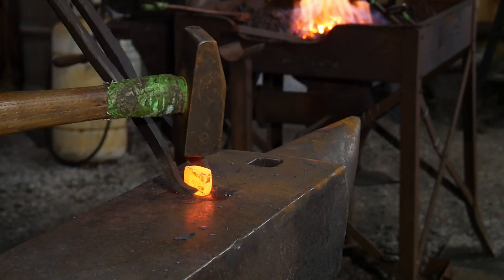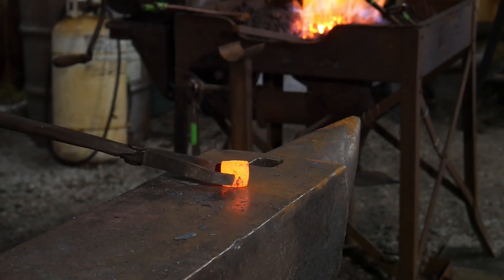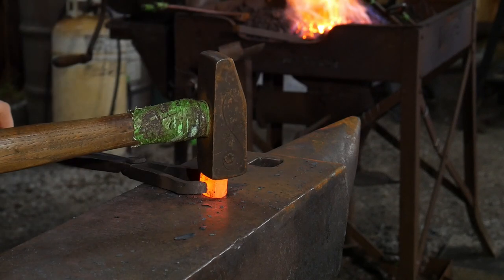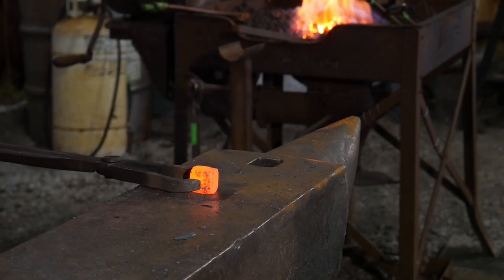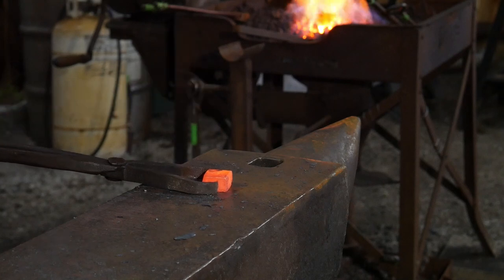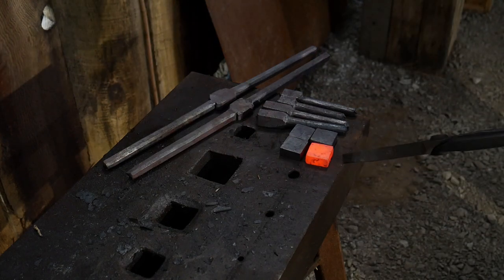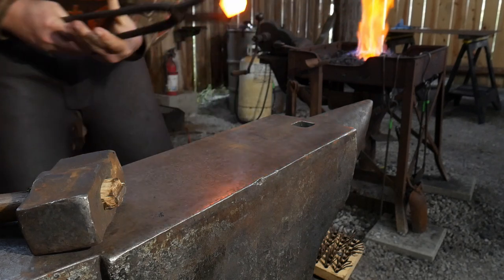There is a little trick here: you do have to have enough mass that you can actually catch some threads, so be real careful when doing this. If you don't have enough mass when you cut off the piece and it's not thick enough in the final dimensions, you won't be able to catch any threads and your door knocker will fall off. You can see all the little parts laid out - I've got multiple door bolts and multiple nuts there.